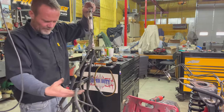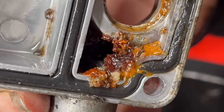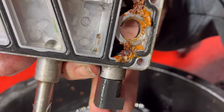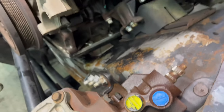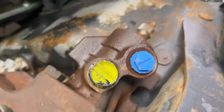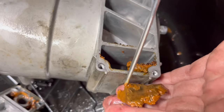This is our water and fuel separator — see the sensor right there? There was no amount of draining. Once that sludge is there, it holds water. You'll drain it and then it's the sludge — clean that out. Eventually we'll get to how you're supposed to be doing stuff. Get the lines out of the way so you can wash them and cap them, because this line right here has got that plug right there. The best way to keep track of it is just to wash the whole line with that connector because that's the only connector I want. It's disgusting in there, so just leave it on there and wash the line — because that line is trash, it's leaking.